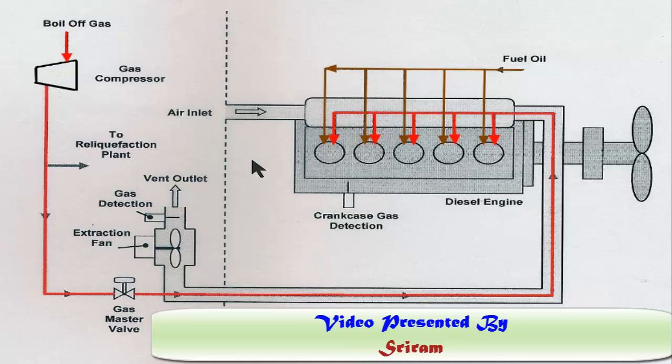In this video we will talk about the basic safety system for a dual fuel diesel engine. The dual fuel diesel engine operates both on the boil-off natural gas and fuel oil. On board a ship, the fuel oil from the main fuel system by the circulation and supply pumps acts as standby, and the engine delivers power by running on natural gas.